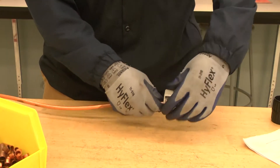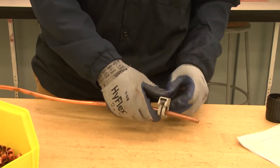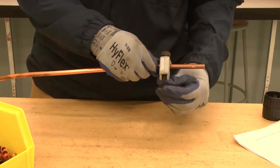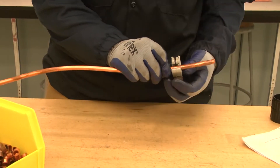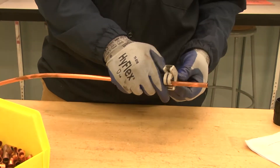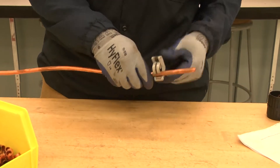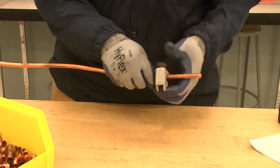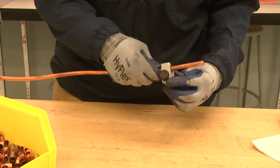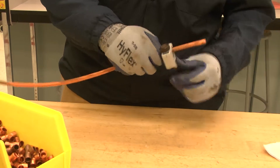Once you're doing it, you want to do about an eighth of a turn, and then turn it whichever way you prefer, then keep tightening it a little bit as you go around, because the blade will actually sink in and start to cut it. You can go around as many times as you want, but make sure you're turning it as you slowly go around. Don't do it too tight because it will dent the pipe and give it that little oval shape that you don't want.